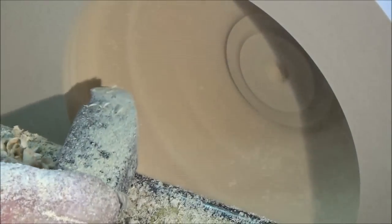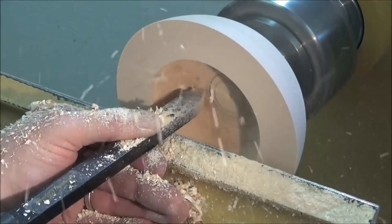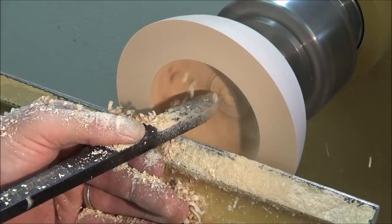Let's see how far I can undercut with it. We'll make a little cut here first, then get rid of some of that wood in front of the cut so I can sweep this round. Nice undercut — very difficult to do that with a gouge; a scraper is going to tear the wood. Bring that to the middle and then finish off the middle.